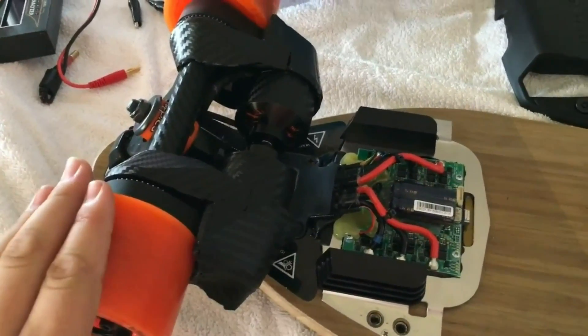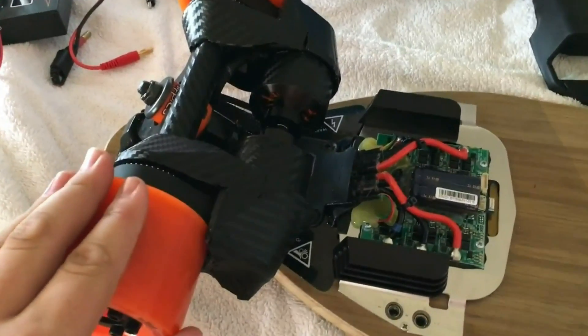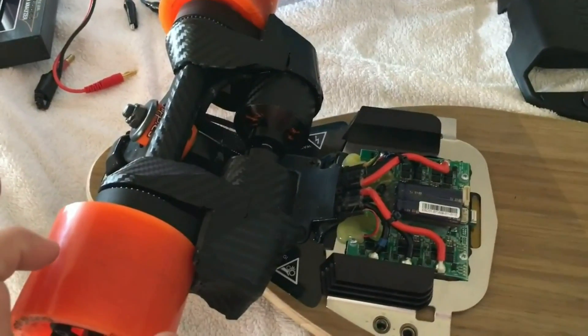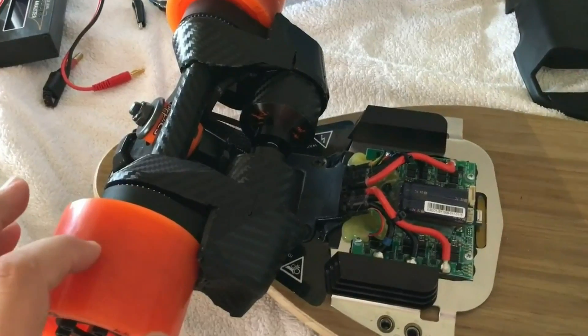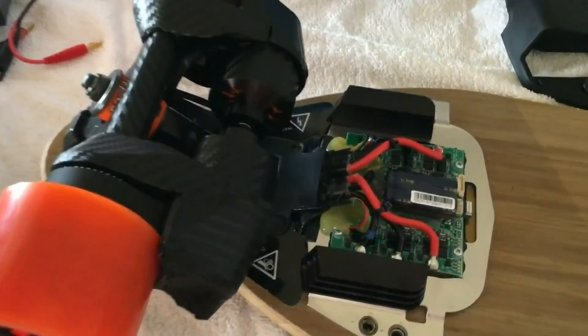These ones, usually coming at 50 millimetre, would be between 270 to maybe 330 KV, which means they've had to put more turns into the motor. More turns means more torque, but also increases resistance because they're able to fit fewer copper strands. If I zoom in to the motor, you can see that they've put quite a lot of copper inside these motors.